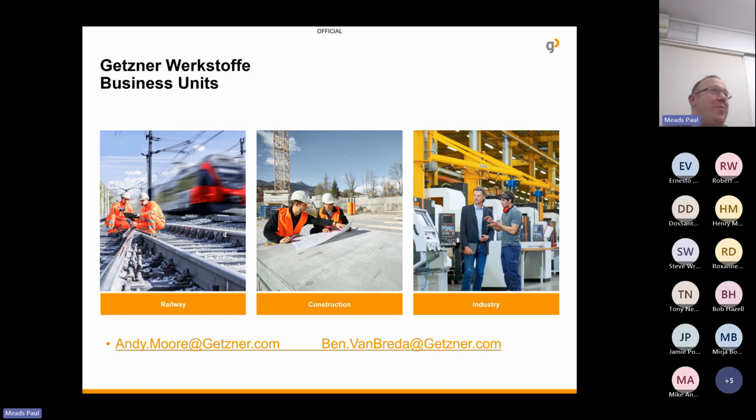Really? Yeah. Point operating, there are so many suppliers out there for drive motors and torsion drives that they do the waveform on the traces that we monitor through our intelligent infrastructure team. So I'd probably say if you've already got contacts within the intelligent infrastructure network at Network Rail, to have a chat with them, because they monitor everything. It's not just track discipline. Right. And they're looking at things like that. And that's an old practice, to be fair, remote monitoring of drive equipment. But locations where we've previously had non-undersleeper pads and where we have renewed with S&C, in this case, that's an opportunity there.